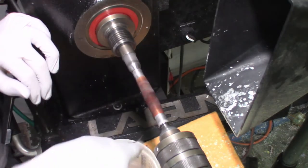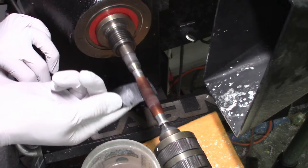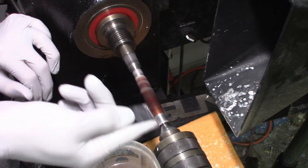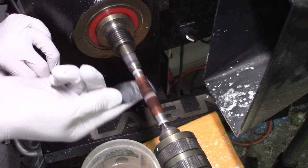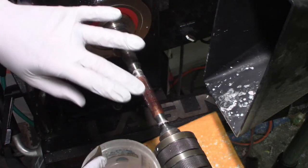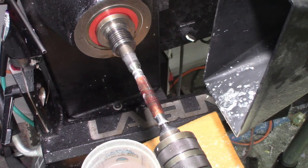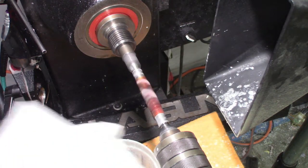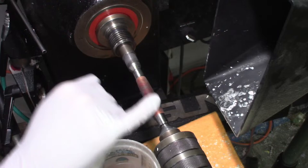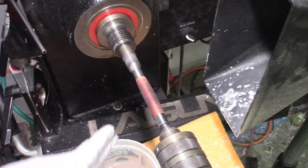All right, so I'm starting here with 600 grit. I'm gonna give this a good once over. Make sure I've gotten all my tool marks and all that kind of good stuff out. Feeling pretty smooth at this point. There might be a tool mark right there. I think I need to rotate my cutter on that carbide cutter. I was using a negative rake. I think it's time to rotate it, possibly. Oh, no, that's fine. Okay. I still think I need to rotate it, possibly, because it's just not cutting as well as it used to.